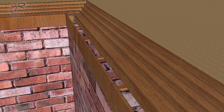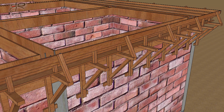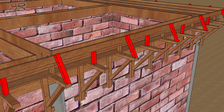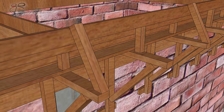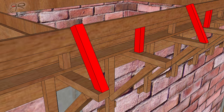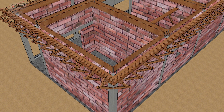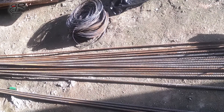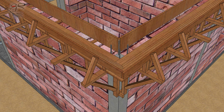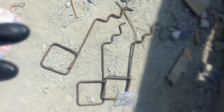These additional supports are illustrated here. There are quite a number of ways it can be done; this is one of the many ways in which these supports can be placed to prevent breakage for the formwork. When this is achieved, the next step will be for the reinforcements — the rebars — to be installed. The ironworker will place these reinforcements, and the links for the beams are prepared especially to take the shape of the concrete fascia.